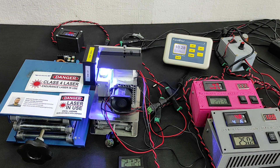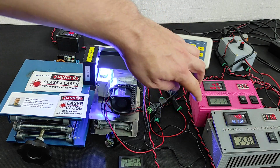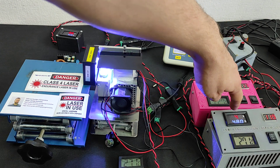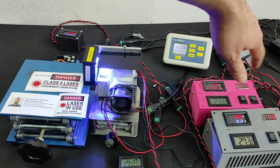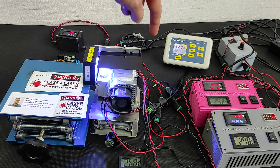You see that our calorimeter — both beams are heating the calorimeter, and you see the temperature now starts getting higher because the lasers generate heat. We need to remove about 17 watts of heat, because 4.8 volts multiplied by 4.8 amps is close to 23 watts, and we have about 7 to 7.5 watts of optical power, so we have about 15 watts of heat power being generated.